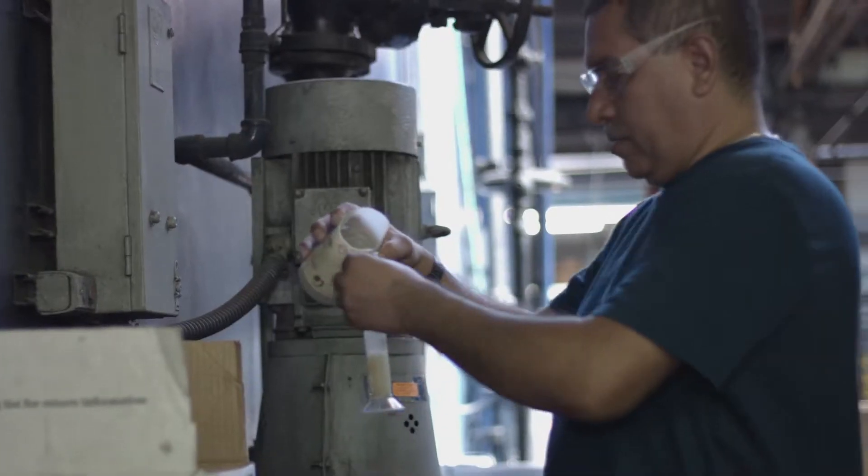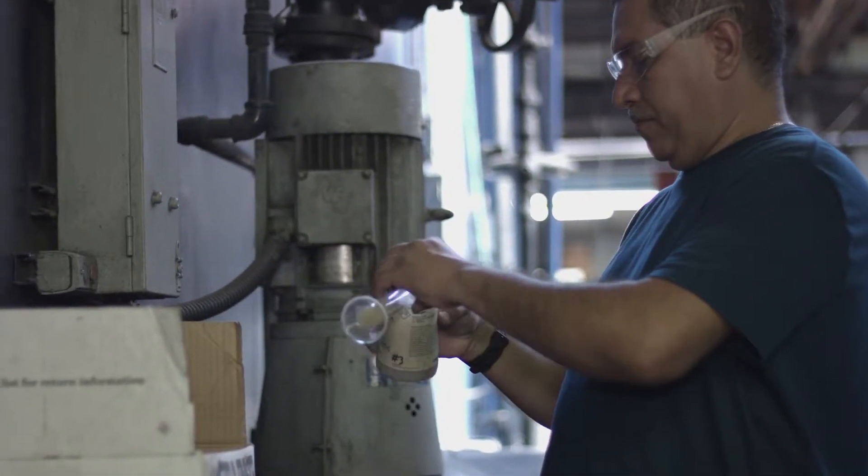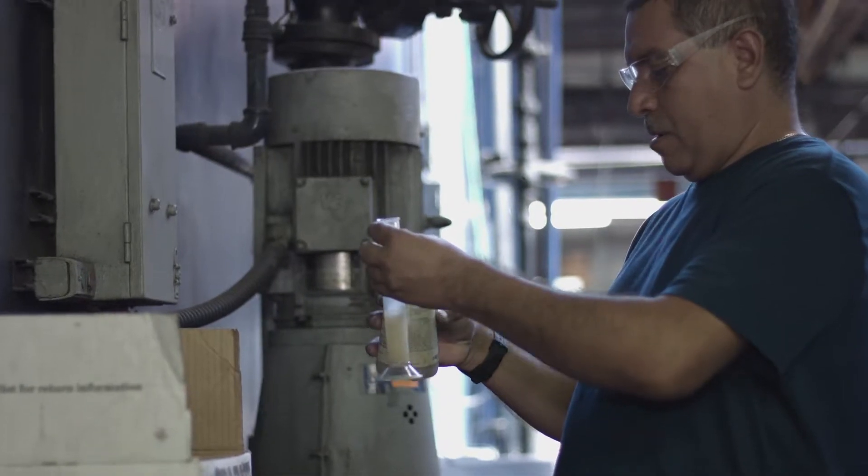Here at SNB, we have a five-stage washer system. There are two chemical stages out of five, and the remaining three are rinse. One of the tests that we perform is the water break free test, which gives you the cleanliness of the parts that you're going to paint.